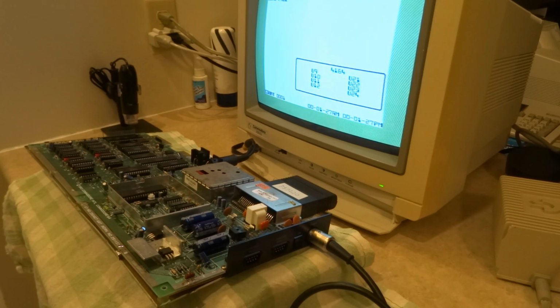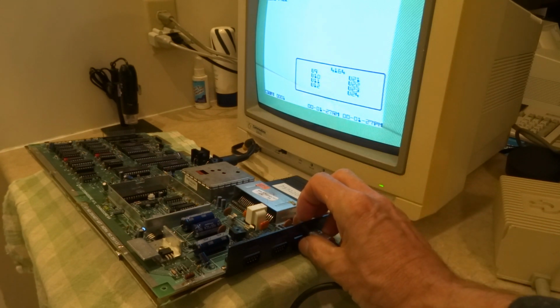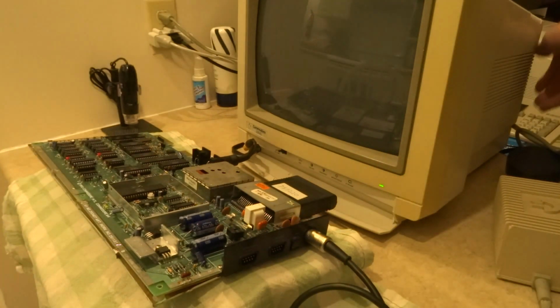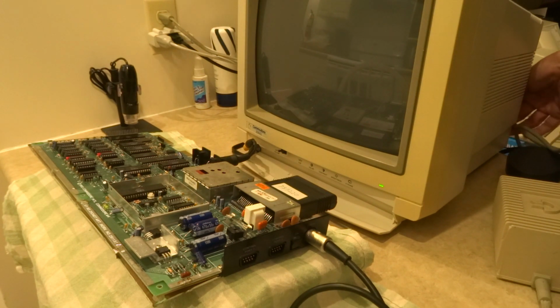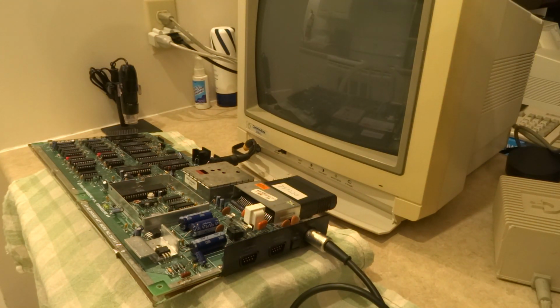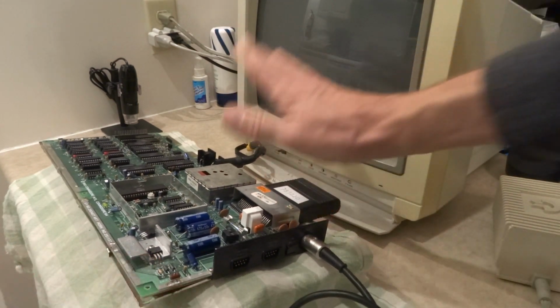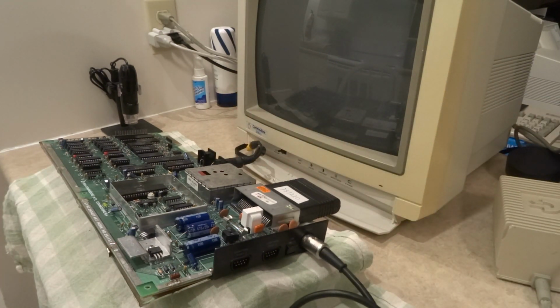Okay, so that just taught me something. The clicking is always there. The volume is the problem. So the clicking previously that we heard was normal, but the audio itself was way too quiet. So we need to see if it's a SID chip or something related to that. So now at least we know where to start from. The clicking is normal, it's just the audio is way too quiet on the other computer. So I'll just hold off for one moment. We will take this apart, the Commodore 64c, and see what is up.